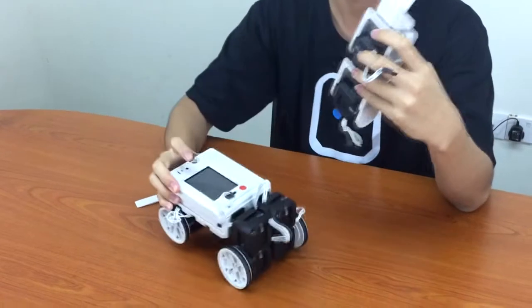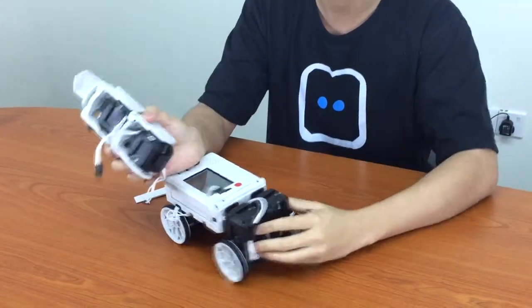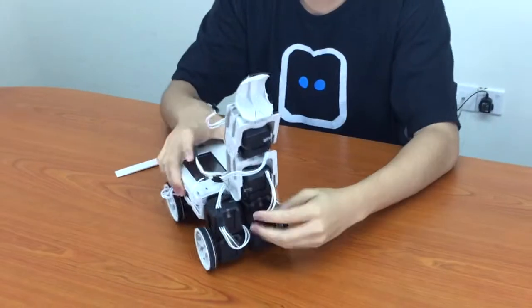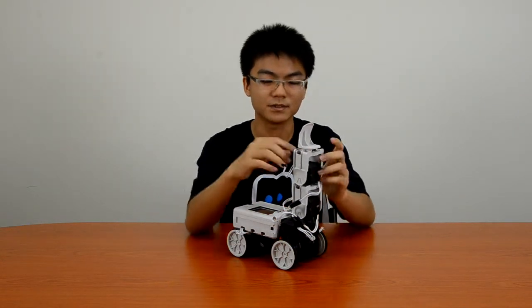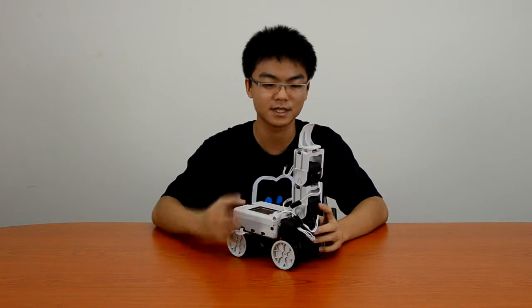Once you're done, this is a car robot. Slot in the interconnect on the front of the robot — you can slide it in anywhere, but put it here so you can see it clearly. Remember that you have to connect the wires yourself. Now I've connected all the wires. The servos for the arm are not connected to the controller, so remember you need to connect all the wires to the controller — whether you use daisy chaining or extension wires, as long as the servos are connected to the controller they will all work.